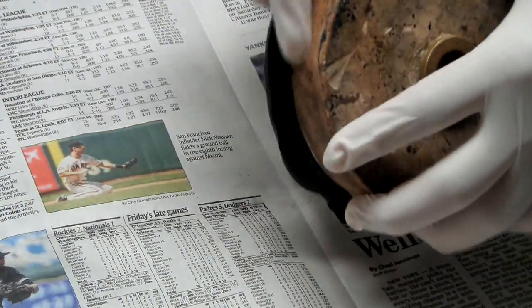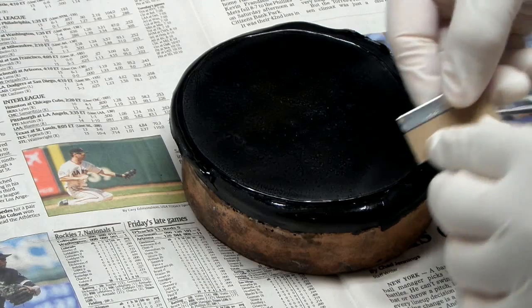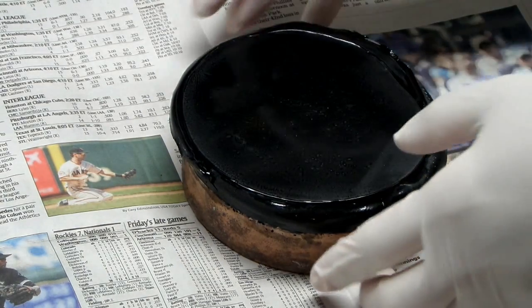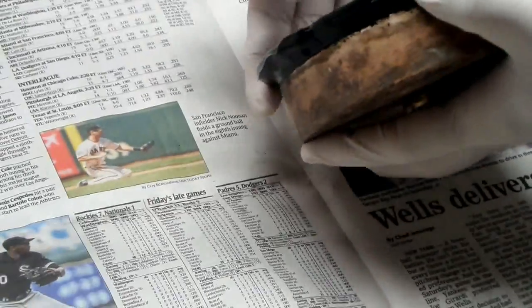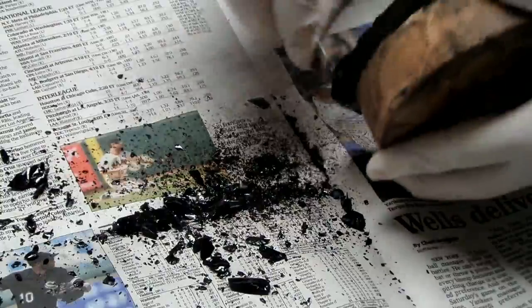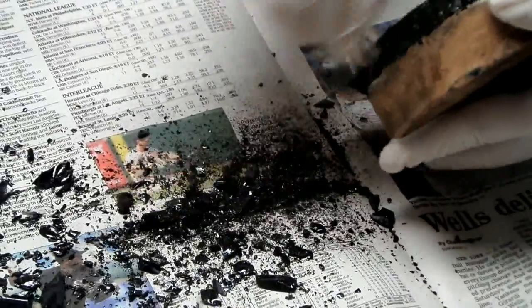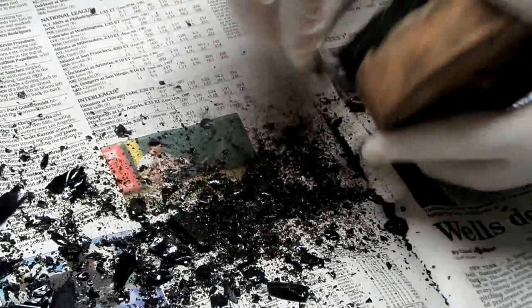You can see there's overhanging pitch on the edge there. To cut pitch laps I just do it by hand. I use a brand new single-edge razor blade for every project, every different pitch polisher. First thing I do is get rid of that overhang, so I just put the lap on its side and use a slicing motion. Just go all the way around — the pitch crumbles off pretty easily.